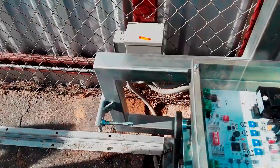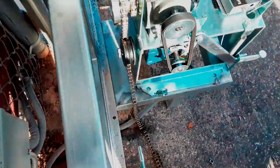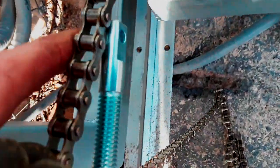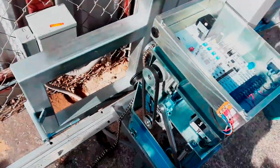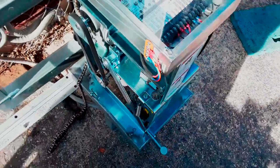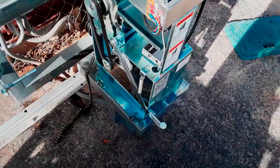I have it going through the drive gear and the idler wheels. I'll put pressure on it to see how tight it's going to be - maybe one or two more links. I'll put pressure on it, pull the chain up to the eyelet on the chain bolt, break that link, put a master link in, and attach it. Then we'll manually open and close the gate once and put the cover on - once we see there are no obstructions and the gate operator does not need to be moved, we'll finish welding it down.